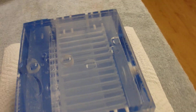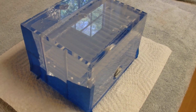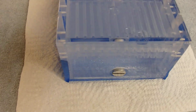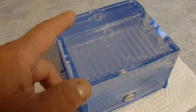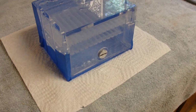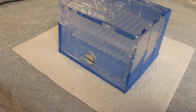What I recommend is lighting it from the bottom, having strips that face up, little SMD LED strips that face up. They even have RGB ones with little controllers. You can get them really cheap. And you can get an amazing light show out of this, because the face of this is 3/8 acrylic. The whole thing is 3/8 acrylic, cell cast, optically clear. And the face has a 45-degree bevel that kind of acts like a prism, and it'll throw those light patterns around. It's really neat to see.